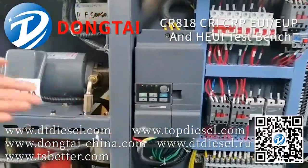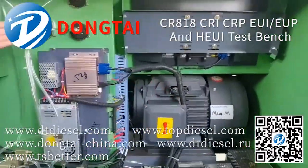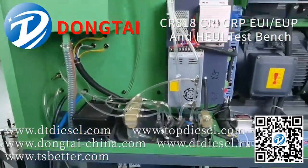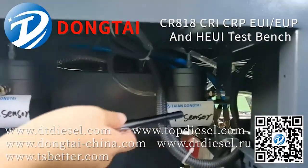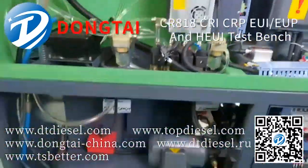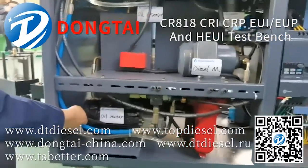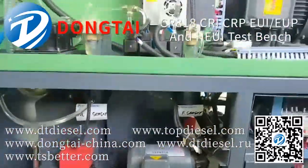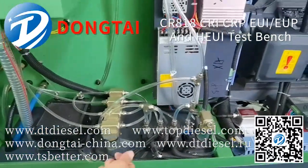Frequency converter. Main motor for this test bench. Control unit. We have three flow sensors of this test bench. Oil flow sensor, pump flow sensor, and injector flow sensor. Also, we have three motors. This is for oil supply motor. This is diesel supply motor. This is the cooling fan, filters, solenoid valve.